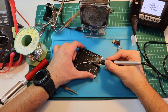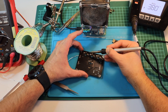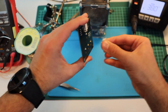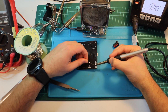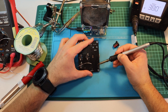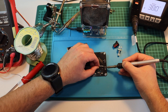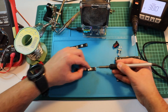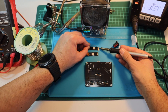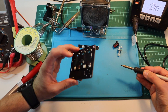Although I've explained the pick-and-place machines and the SMT assembly process, it's totally possible to do it with a soldering iron and this is exactly what I'm going to do for this prototype. Thanks to the magic of video editing I'm going to speed up the process. Hand soldering SMT components is not difficult but it is time consuming. First, solder one leg of the hot-swap socket to one of the pads, make sure it's firmly there, and after that solder the other leg. While soldering, make sure the sockets are in the right direction — I made a mistake with the direction of a couple of sockets and had to turn them afterward.